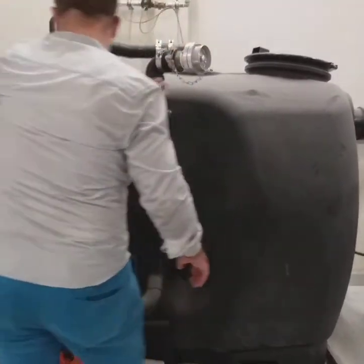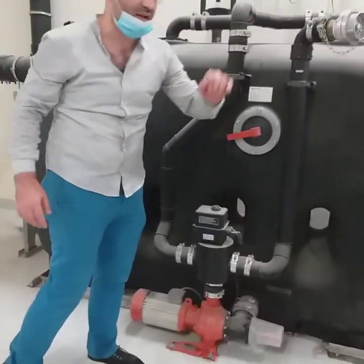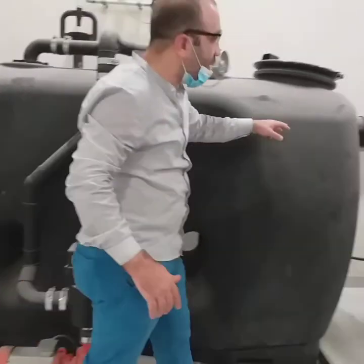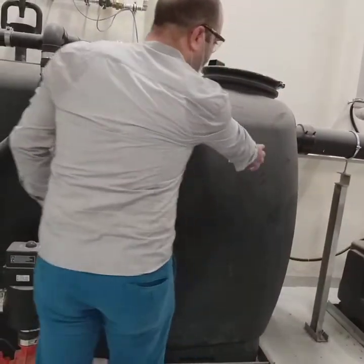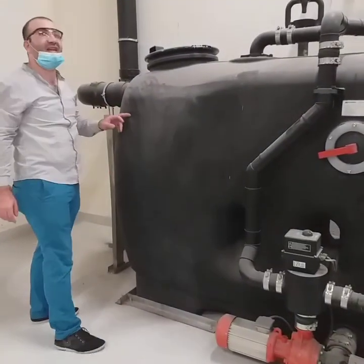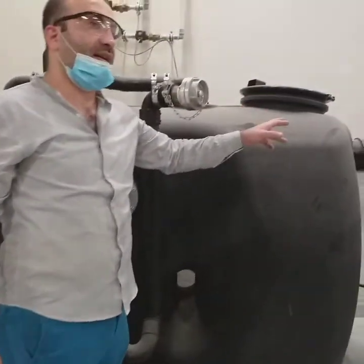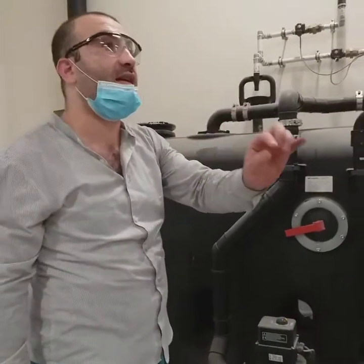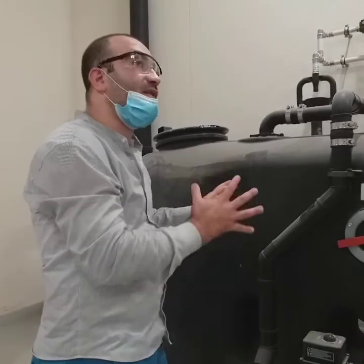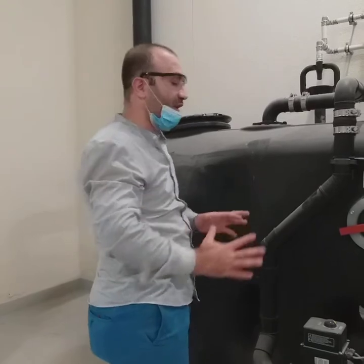So in this area here, all will be occupied with grease. In the area downside, it will be occupied with sludge. And that will be kept with the clean water in between, which will be going to the outlet. And there inside, the baffle will take only the water collectively, connecting it from the clean zone. By EN1825, the grease at the outlet should not exceed 25 milligrams per liter as per the law, or to clean 97% of sludge and grease. You have to comply with this in order to be certified as per EN1825.